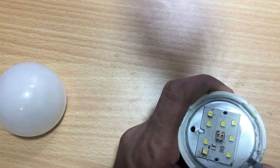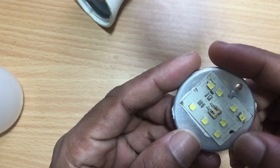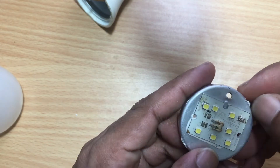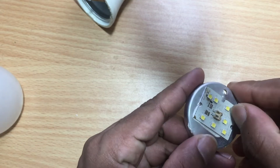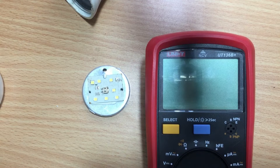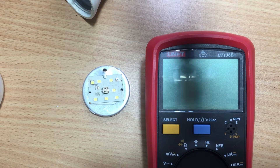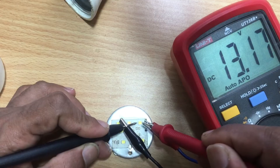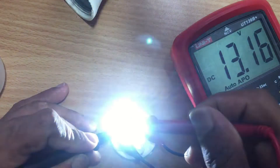Stay with Set and Fix. First, check the LED chip wiring. Normally those are wired in series. Give a small voltage first and check the lighting voltage, because some LEDs are 3 volts, or maybe 6 volts or 12 volts. Since I have repaired this before, I found that these LEDs are 12 volt chips.